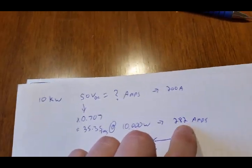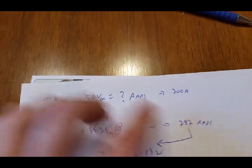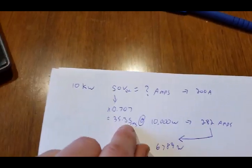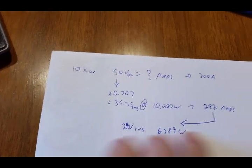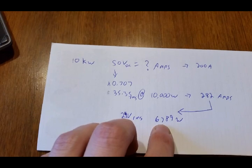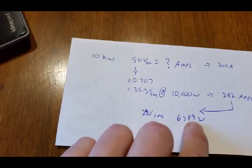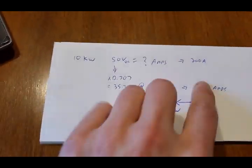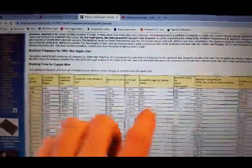Without some super cooling you can't exceed 282 amps without burning something — that's the number I'm planning the inductor around on the AC side. As a side note, my transformer is at 24 volts RMS, so it can't do 35 volts RMS. I need to derate: 24 V RMS × 282 A gives about 6,789 watts, which is less than 10 kW and also less than the transformer's 7,500-watt rating, but it's the best I can do. Now, knowing 282 amps, I'll use this chassis wiring chart — I'll link it in the description.